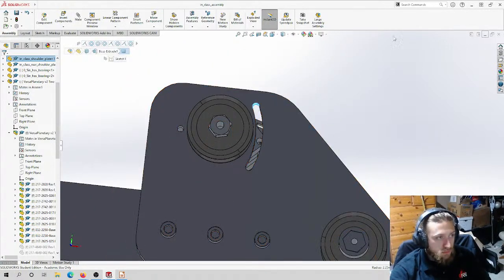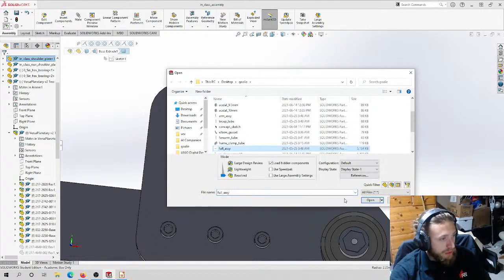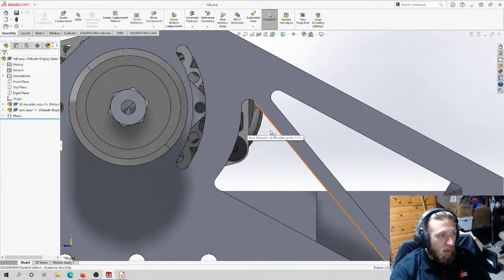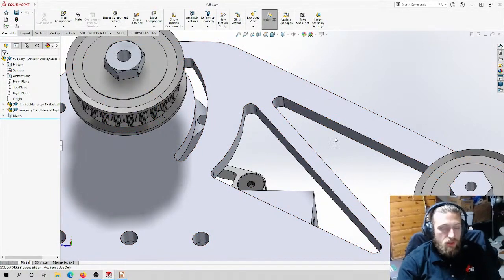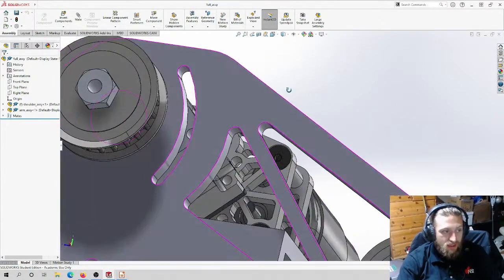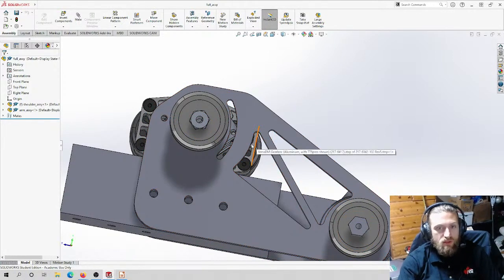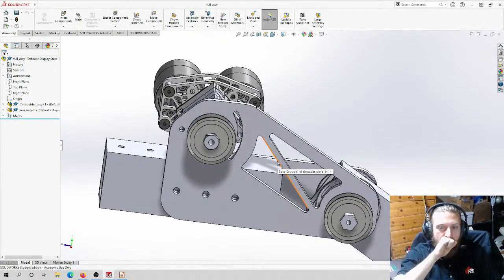So you saw in my other design, I had these pockets, right? I manufactured these with CNC in mind. This is a 1/4 inch radius and a 1/8 inch radius, which means that I could manufacture this on a CNC. That being said, this could also be water jet, meaning the internal radius doesn't matter, because water jet can do much smaller internal radiuses, basically to the point where it doesn't matter too much, because water jet is just a stream of water.